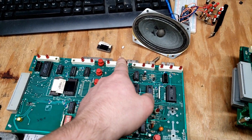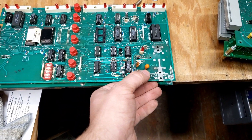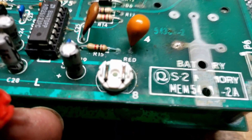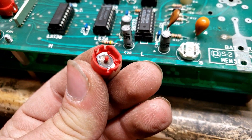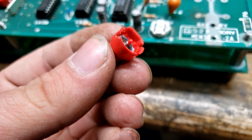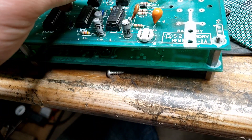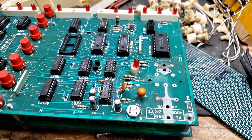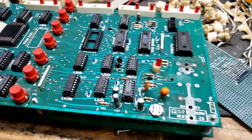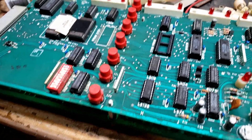Here's the board set back in the workshop. There are a few different ways we can fix that, but the main thing I want to focus on right now is this button doesn't work — it is stuck down completely. That button enables pricing, so that might be important to not be stuck down. Goodness, that's a lot of corrosion. Not sure how it's supposed to work... oh, there is a spring in there. I don't think any of this is working right. I think we're going back to my first plan of throwing this in an ultrasonic cleaner. I'm going to pull out these EPROMs mainly because I don't want to soak the labels, and throw this thing in the ultrasonic cleaner.